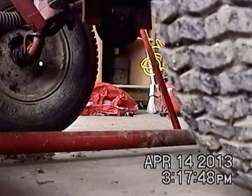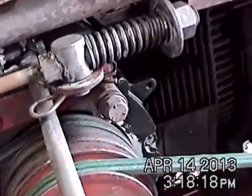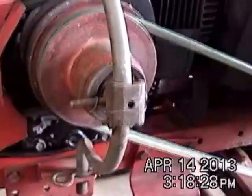There she is - so that's released. Now the only thing you need to do is your belt off of your PTO. On a 195, the outer groove is for the blower. This center groove would come down here and go up to your mule drive for your mower deck. Then there's a big space here, and then this belt there is your hydrostat belt that goes underneath this back to the pump. The neat thing I love about Wheel Horse implements is that it's just so simple to do these belts.